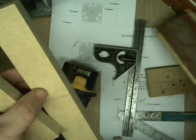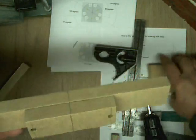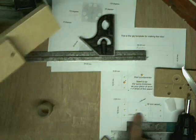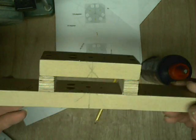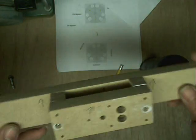Another little tip - so you can get your material in and out properly, your wheels or whatever you're building, just take the corners off. Now we've got them to screw together, we can now cut that template out, screw on there and drill all the holes. Right, that's our little jig all made up.